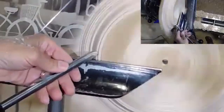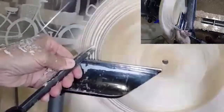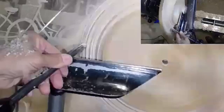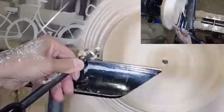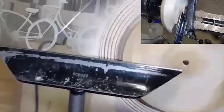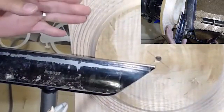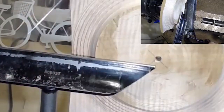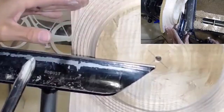This is that pivot cut I showed you right at the very beginning. The next part of this is really exactly the same as I've done on the outside. I'm going to continue making push cuts, getting a final surface, then approaching it with my sharper tool. If there's any ridge in between where the previous first two inches were and the next few inches, I'll use that shear scraper to get out any little ridges.